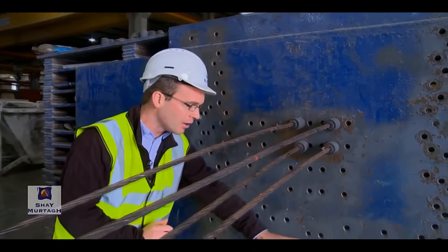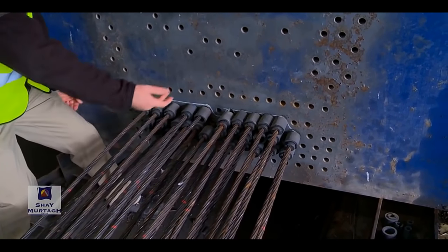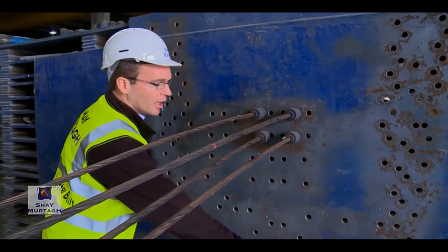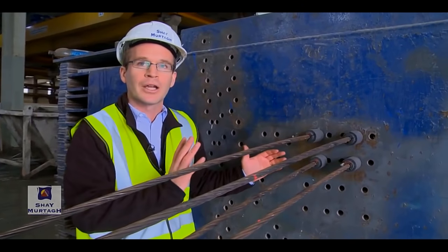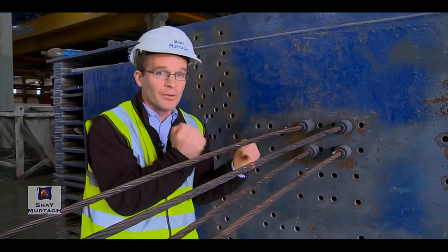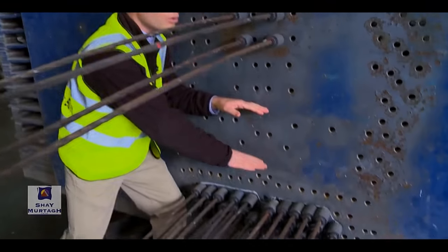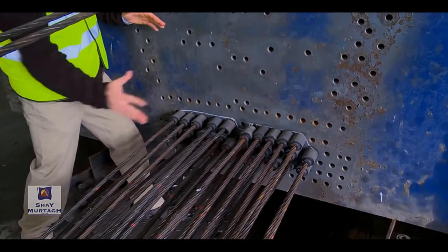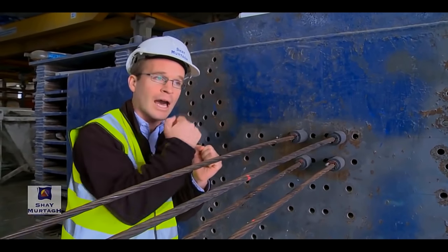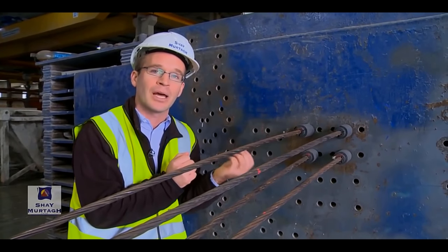Notice with this strand layout, there is a far larger number of strands closer to the bottom of the beam. The soffit of the beam would be just 50 to 60 millimeters underneath the actual bottom of the strands. This is because we want to apply not only compression but also a bending moment to the beam. That eccentric position — removed from the centroid — enables the pre-stress to apply a bending moment that counteracts the bending moment from applied working loads.